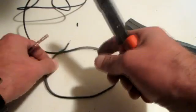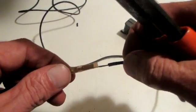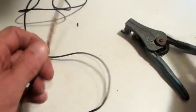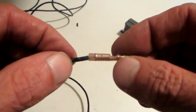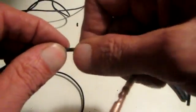Then I like taking a bigger size crimper and crimping the back of the splice as well — the part that holds the insulation. Just squeeze that a little bit tight and snug, but don't go crazy with it, because sometimes you could cut into your insulation and make your splice not as good as it should be.